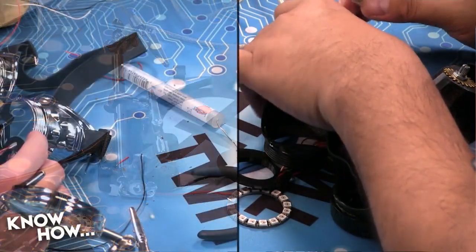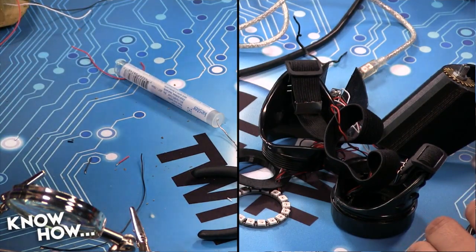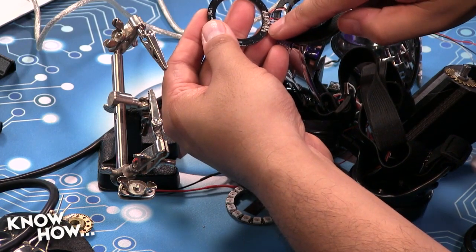How are you doing, Brian? All right. Maybe I'll pass over my goggles to you, and you can tell me if I've done this correctly. Okay, let's see. So you've got your wires going through your bridge. You've got it going in. Yep. Although you've got a short right now. Oh, because one of the... I can fix that, right? Like, if you plug this in right now, smoke. Smoke. Okay. See the pad that says ground and then the pad that says VCC. They shouldn't be touching. Right.